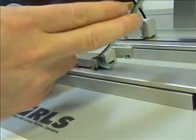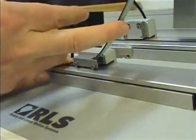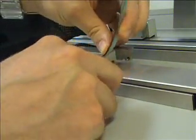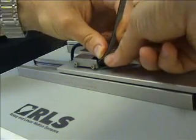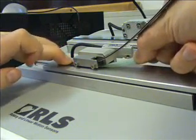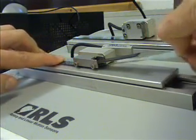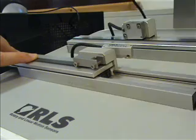Going through a little to start with and coming back, we have the tape on the other side of the screw. I can pull this out now with my finger. As we move down the axis, we can just pull the tape out as we go, whilst pushing down the scale as it's put into position. A very simple operation, and there's the backing tape out.